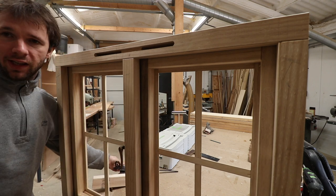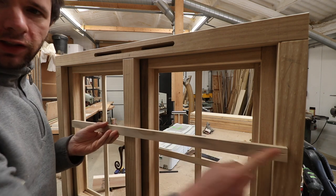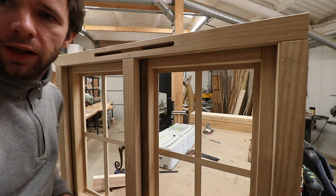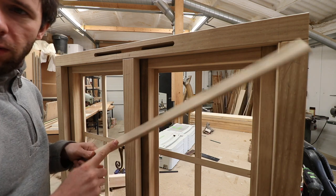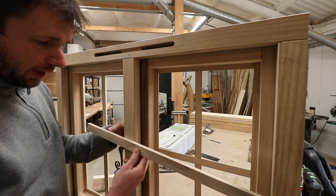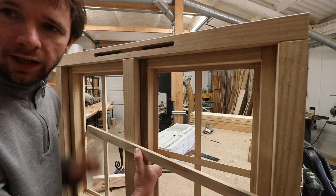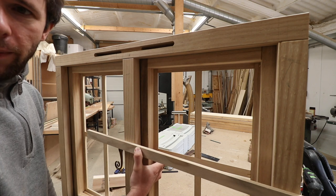Another option is to get a batten — any type of batten, stick, or anything like that that's long enough to bridge the gap between the two jambs or the jambs and the mullion. Once you've located the position of the stay and the fastener and fitted the stay first, you can mark that position on the casement itself, drill a hole in this batten and put a screw through the centre of where that plate of the fastener is. The screw will pull the casement in using the batten as a counter, acting like a stop to work against the screw pulling the casement in against the rebate — so you don't need to get to the outside and wedge the casement shut. You can do that from inside with no dramas at all.